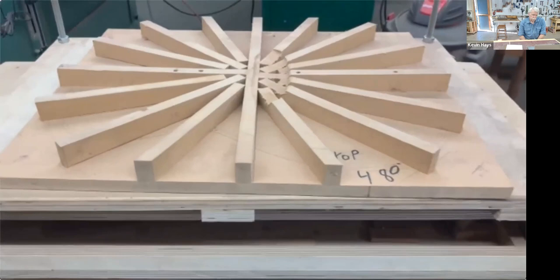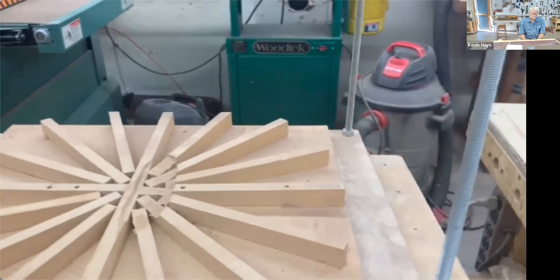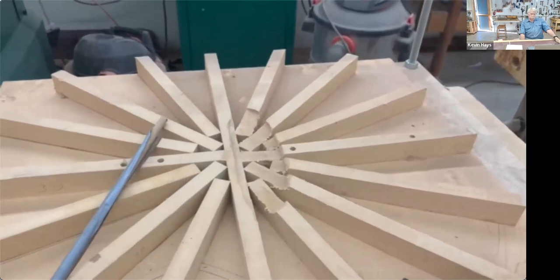Again, we'll show you. Then I'm not sure of the name, a go bar clamp or fixture. And basically, I use dowels. I'll put the top plate down, a brace, get them all lined up with glue on it, and then use this as the clamp. And you can see up here.